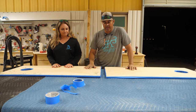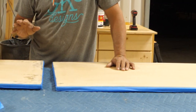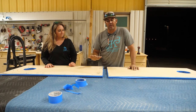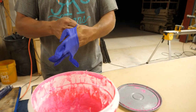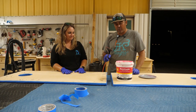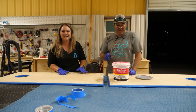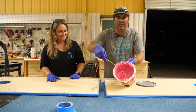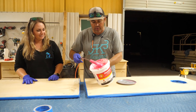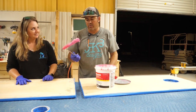The reason why we're Red Guarding these particular cornhole boards is because they are regular MDF. If we were using Med-X MDF, which is water resistant, you don't have to. But because this is regular MDF, we are going to Red Guard it. I recommend that you use some gloves with this stuff. Do you leave the roller in the bucket? I learned that from Rhonda — leave your roller in the bucket so you don't waste rollers.